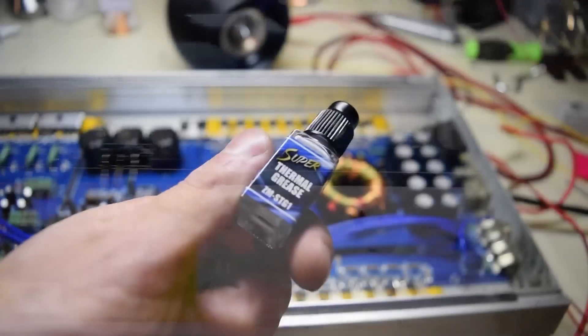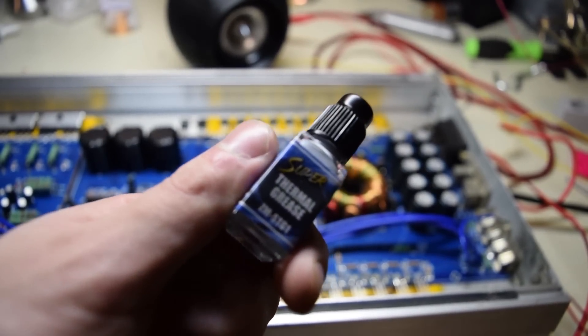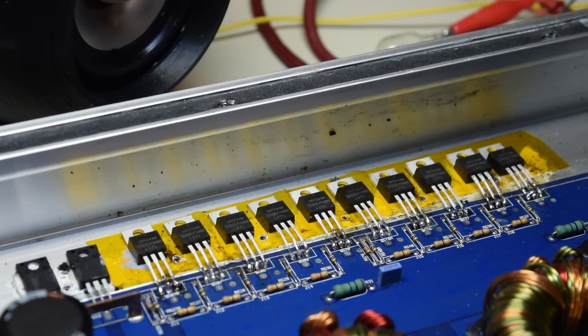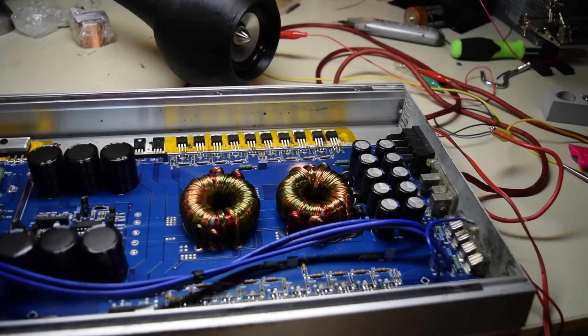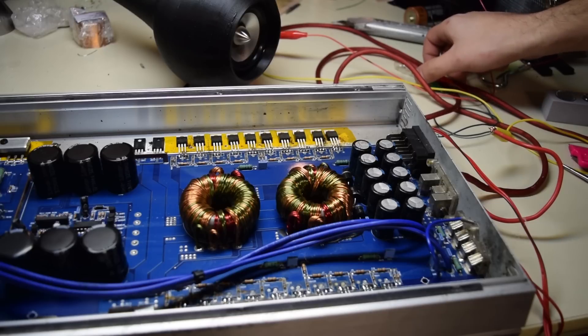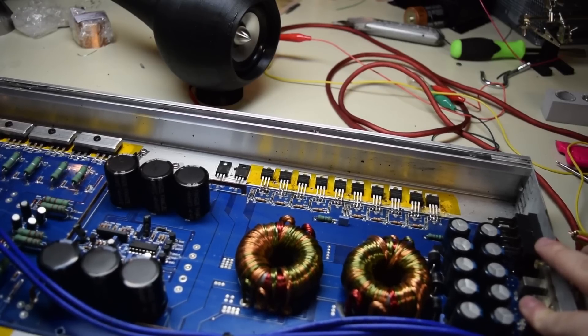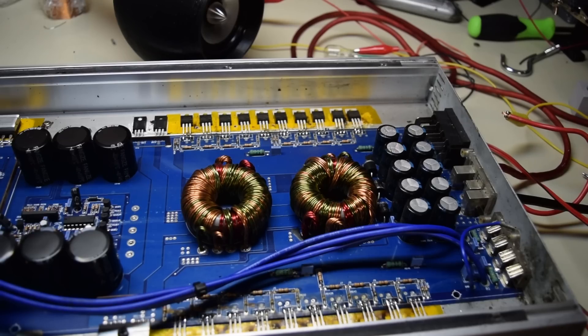Just some finishing touches - I'll add some thermal compound, some thermal grease to the MOSFETs. Alrighty, all the FETs are replaced. Let's go ahead and turn her on, hoping that there's no other issues. If there are, I'm going to be very, very sad - I may cry. Okay here we go... got to fix that light bulb. Oh wait, I'm an idiot, I forgot to plug in the ground. Turn her on - three, two, one. Lights on and we got music! Now let's crank it up a bit.